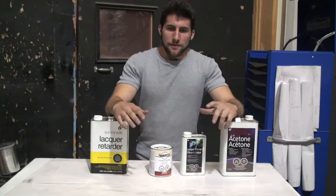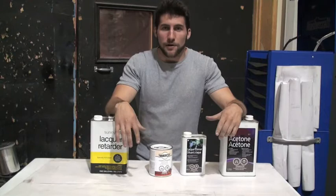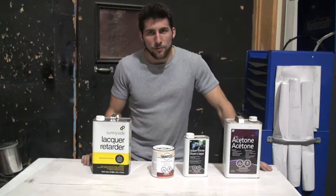The way things are going now, it's becoming more and more difficult to find things like nitrocellulose lacquer, which are obviously solvent-based and hard on the environment and hard on your lungs, but they give a fantastic finish. You can get water-based lacquer, but they dry differently, they spray a little differently, and a lot of people really don't like them.